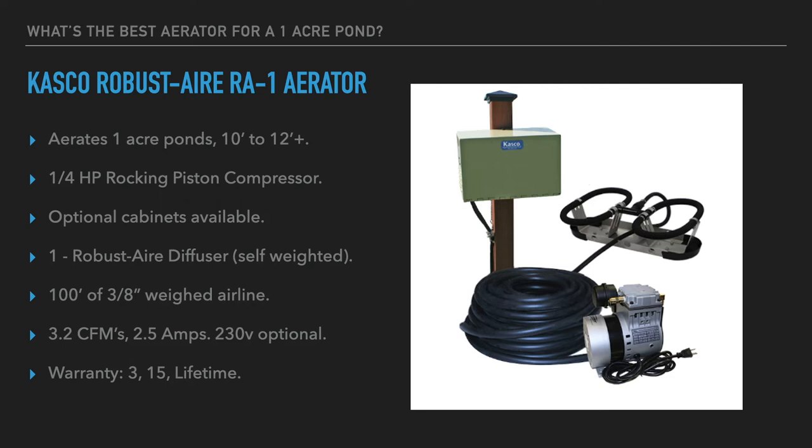Optional cabinets are available, very similar to the EasyPro. The no-cabinet version includes a cooling fan mounted on the pump bracket; all cabinets come with cooling fans built in and soundproof dampening foam lining. The system also features a filter module that senses air restriction and pops up a tab indicating when the air filter cartridge needs to be changed. A side effect of this module is that it reduced sound output by 34%, making it one of the quietest systems on the market.